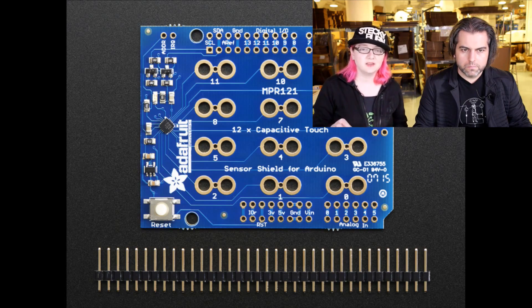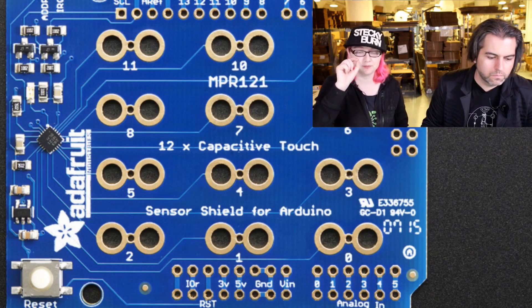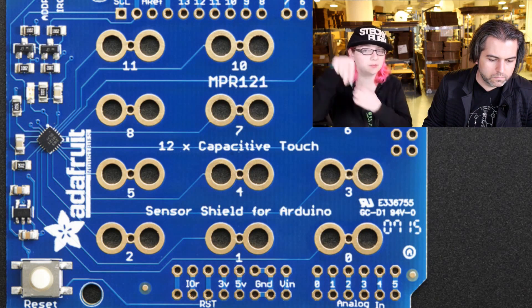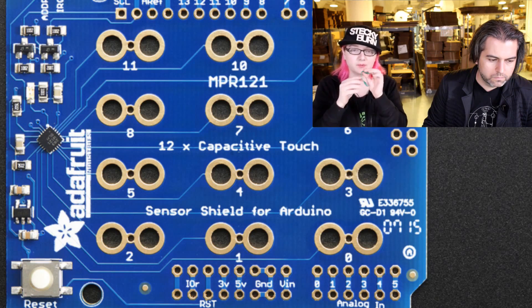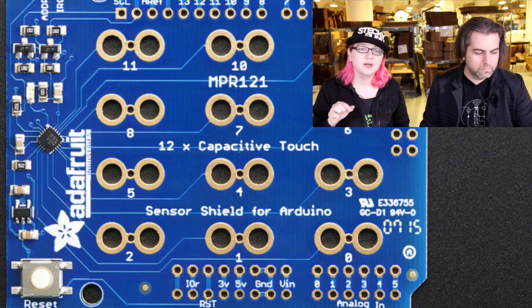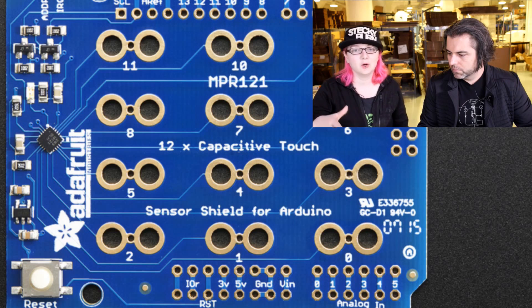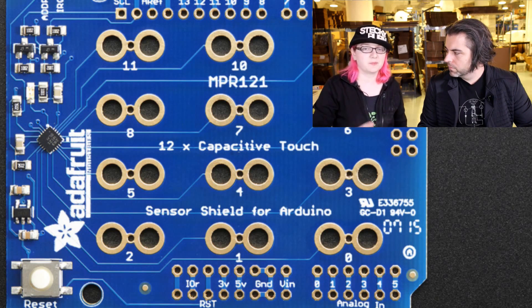As you see, there's these weird figure-eight holes — two big holes and a teeny hole. Basically, it's designed so you can clip an alligator clip onto it and then clip that alligator clip to something else that's conductive. The chip on the left, the little diamond square next to the Adafruit logo, can sense when a person or an animal touches one of the 12 contacts. So it's really good for detecting when somebody grabs or touches something.